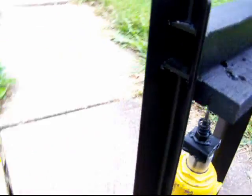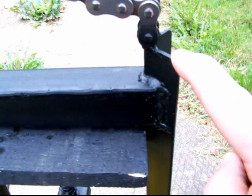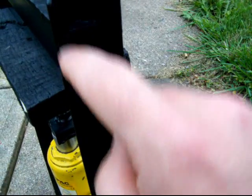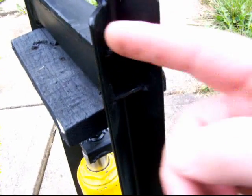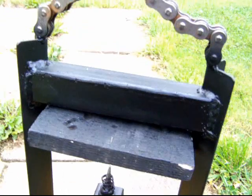I didn't really want this thing to blow apart in my face with four tons of pressure on it. To join these parts in what I figured would be a strong way, with my poor welding skills and lack of design, I actually just notched a big chunk out of the vertical sections of angle and inserted the horizontal bits, then welded the crap out of them around this side so it wouldn't spread the notch out on me. Seems to be holding pretty good — I've done quite a few drives and nothing's moving anywhere yet.